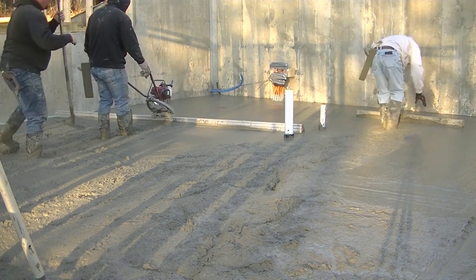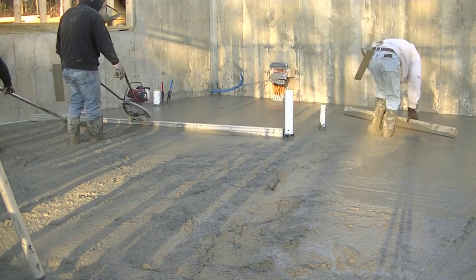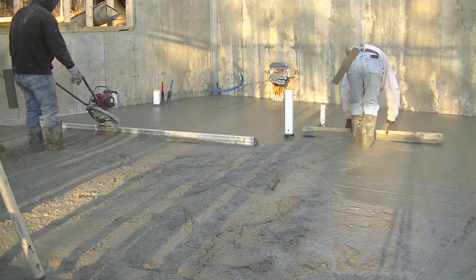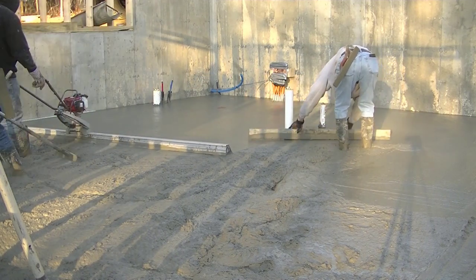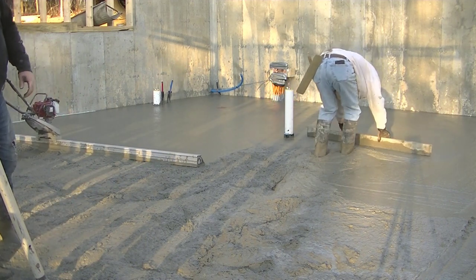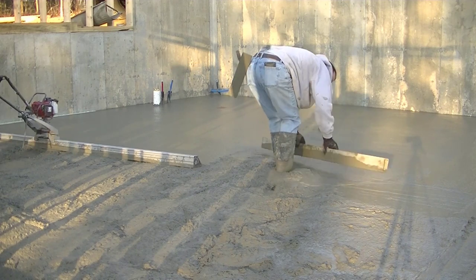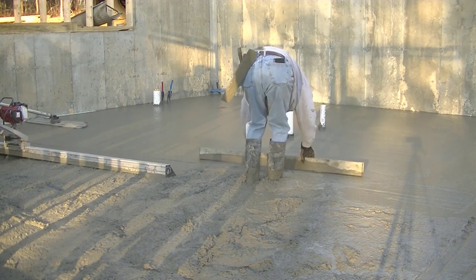There were a lot of trees around so a lot of it was in shade. Up here in Maine the sun doesn't rise very high anymore, so we get a lot of shadows from the concrete walls behind or trees in the way. You can see Darren over there screeding, Luke's puddling behind him, and I'm screeding a small bay with a 5-foot rod. We're getting the concrete down fast, which is a luxury when everybody's highly skilled. If you don't have three skilled guys you'll be a bit slower, so you might want to cut down on your chloride — because once we get this concrete down, we've got about 15 minutes to get it leveled, screeded, and bull-floated before it really starts to set up.